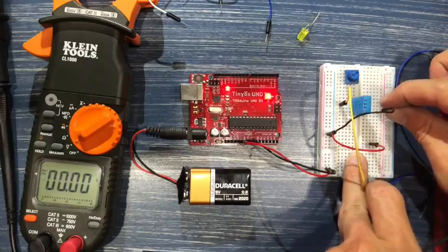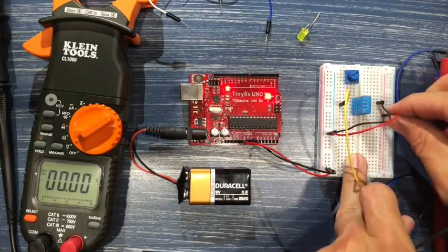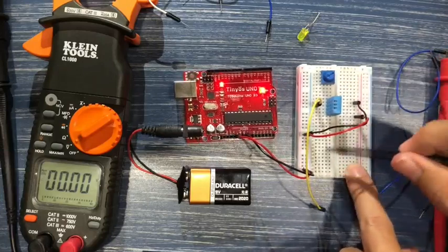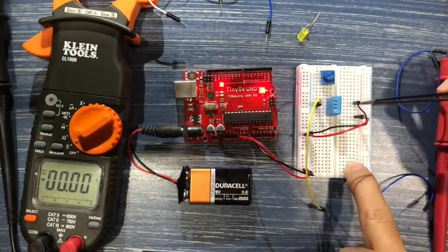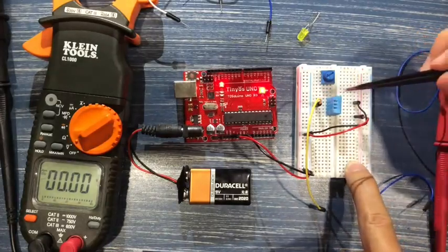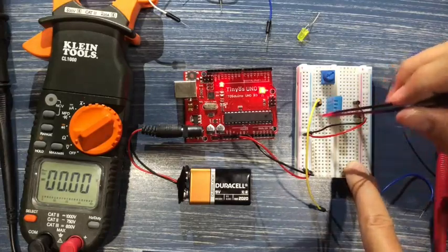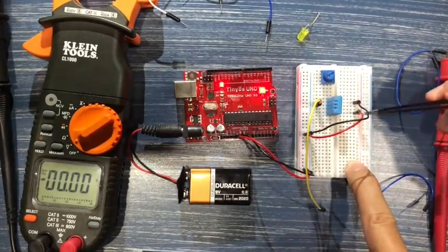And we're going to just connect these. Assume that these are connected. I know that we're not, because the last thing that I didn't tell you about breadboards is there is a division right down the middle here. And this means that all of these pins are completely isolated from these other pins. So even though this side, pin 10, is aligned with this side, pin 10, which is the first pin of our DHT, they're not really connected. And this pin over here, which is the positive, is on pin 14, but it's not really connected to this. Actually, it needs to be on pin 13, sorry, because we're starting on pin 10. So 10, 11, 12, 13.